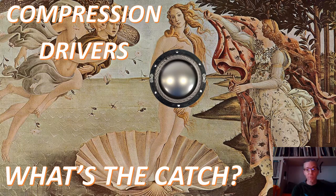But to be truthful, beryllium tweeters can sound really fantastic, and I have friends who have beryllium tweeter speakers and they love them to death. So please do not burn your speakers if they happen to have beryllium drivers. They can be absolutely fantastic speakers, and they do have an absolutely astounding high extension, maybe up to like 50 kHz. They have that kind of strength up to 30 kHz, where another comparable modern tweeter has up to 17 or 18 kHz. So that's just an insane addition, like over half an octave addition to that.